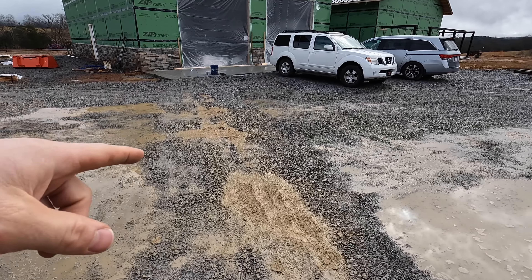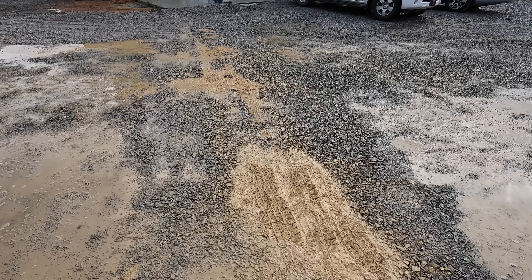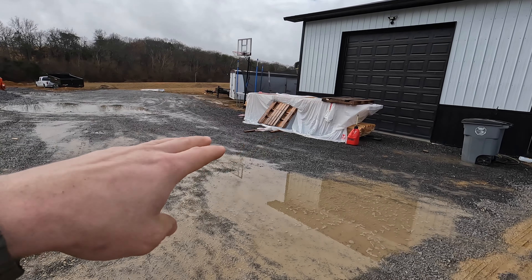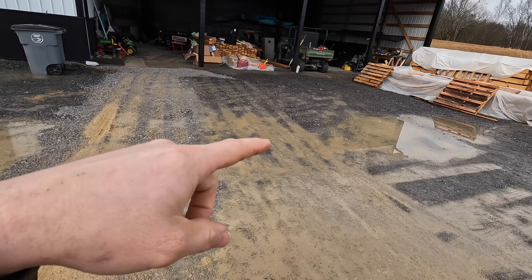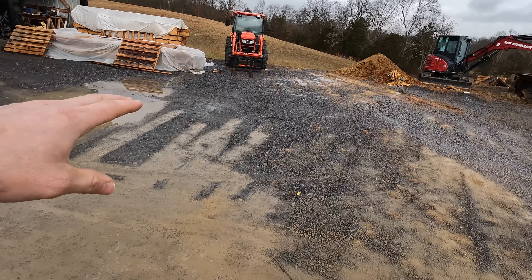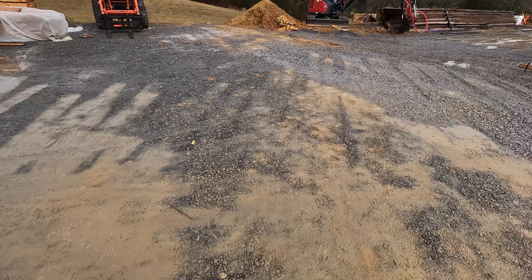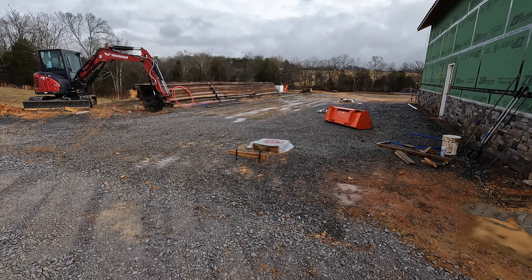Well, the weatherman didn't lie. I got this ditch filled back up last night and put some rock on it — we got quite a bit of rain — but I ran the vehicle over it to try to pack that ditch back in and get it to settle. I've got some final grade work to do in here. I've got everything elevated from the house and this building is elevated so we've got water coming out here. When we cut this slab in, I cut it dead level, which I knew I'd have to come back to. Everything's settled out and it's ponded up right through this little valley. Once I get all these lines and material moved, I'll cut a little swale through here so the water runs the right direction, and we should eliminate our water problems. Back in this corner when I get these trusses moved, I'll take that water off the edge and we'll get rid of it.